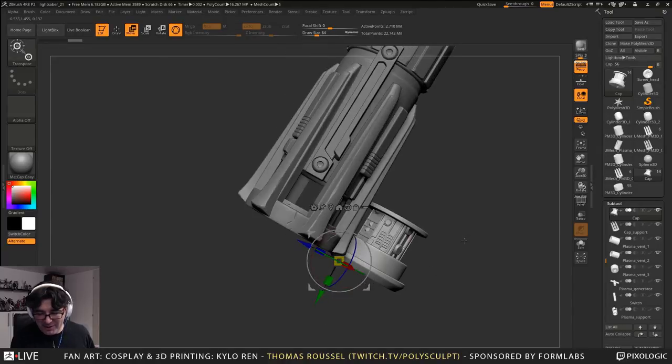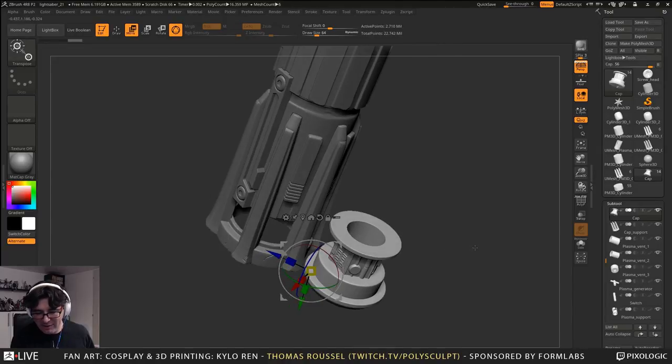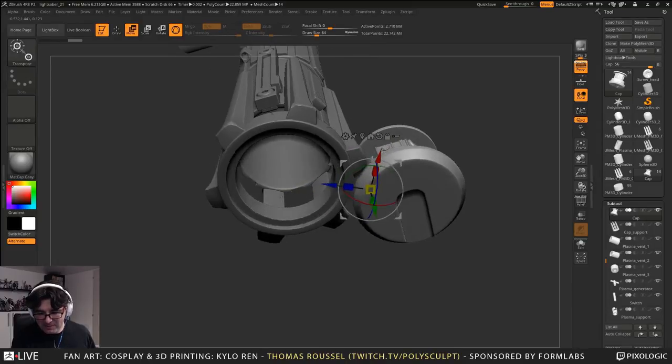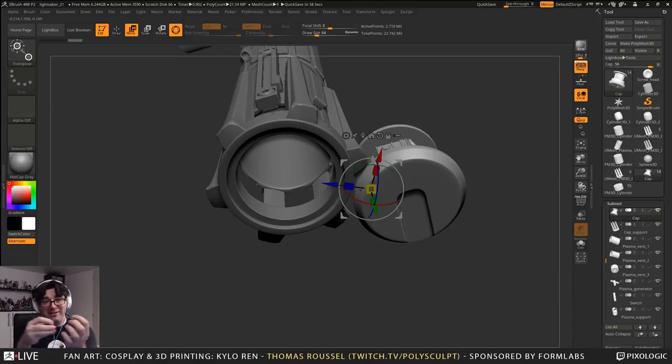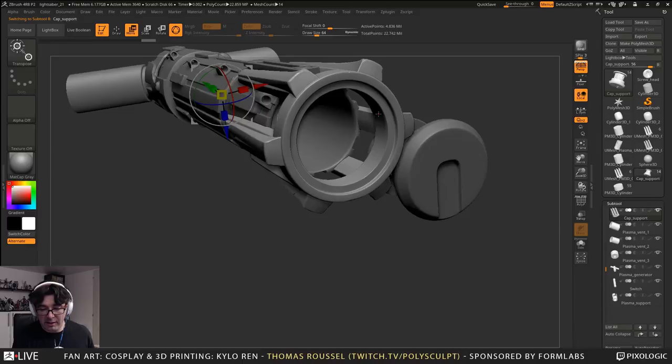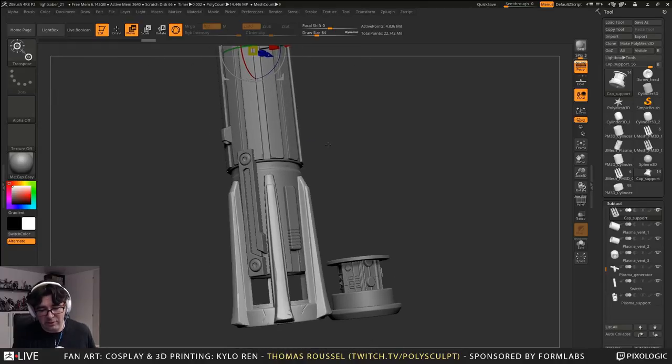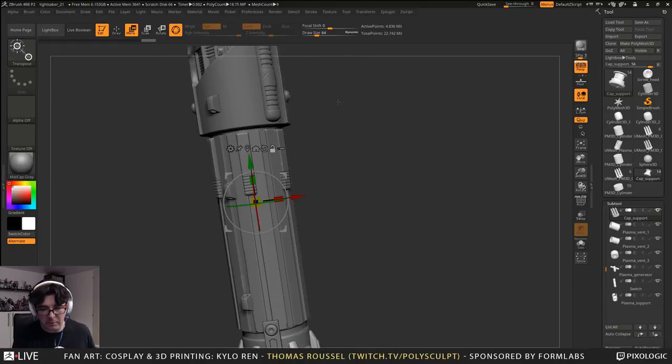The problem is when I built that, you see this top cap here was a little bit too wide, too large for this opening here. Then I printed both parts and I wasn't able to plug both parts together. Then I had to reprint this one by changing the radius of this opening from this circle to be a little bit wider. Then I have an extra part. This is the first mistake I did. It's a small mistake, but you need to reprint some part, which can sometimes be very annoying.